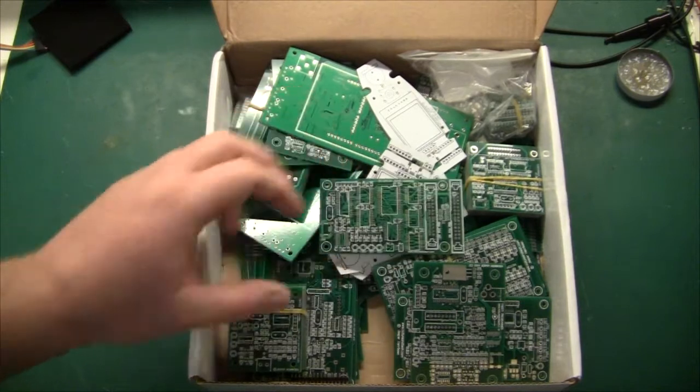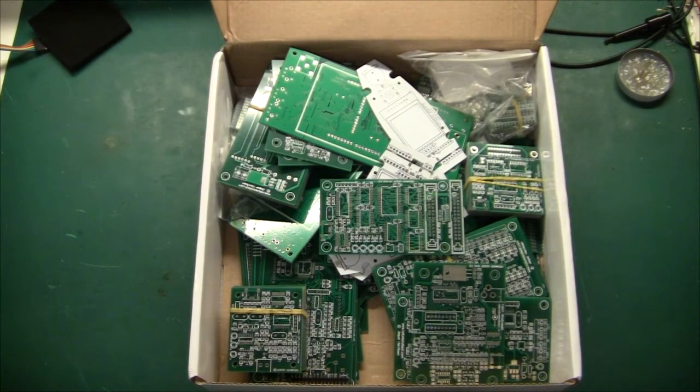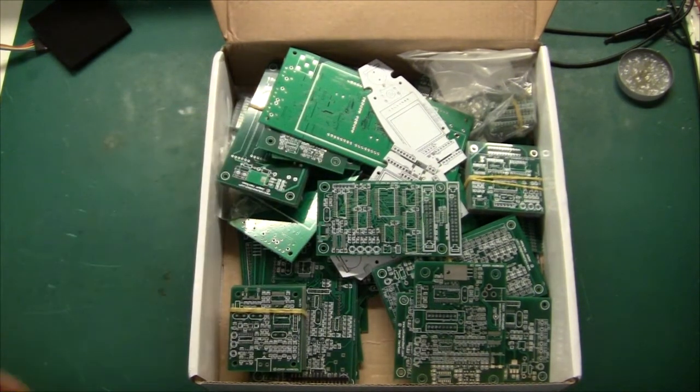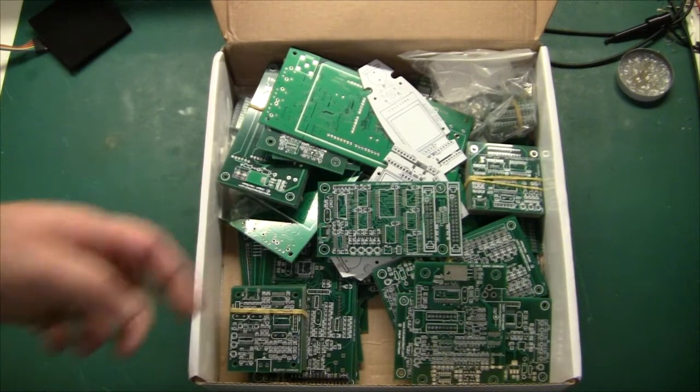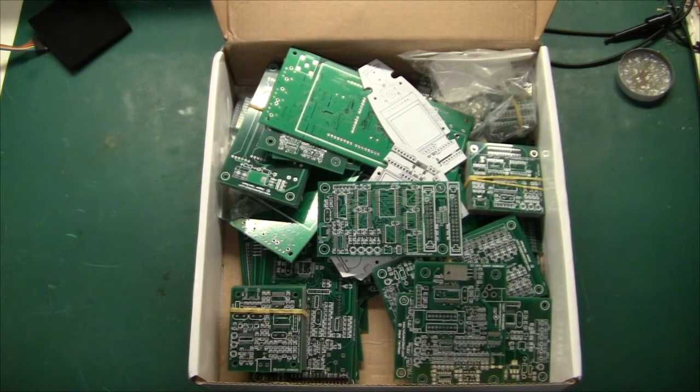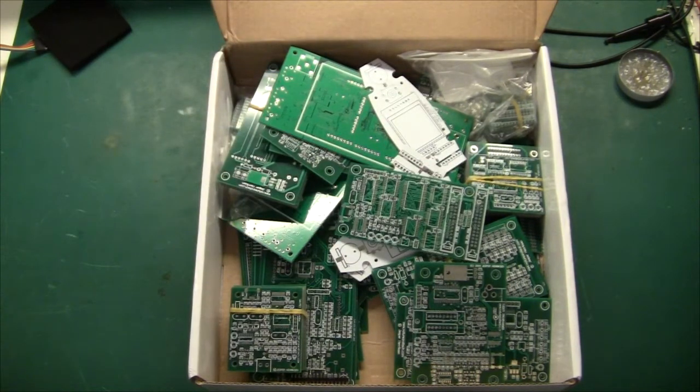So I've done an EEPROM emulator. It's not very high-tech these days with microcontrollers and all that, but I'm still playing around with old microcomputers, so I thought it would be interesting to do. This design is based on an ISA bus design I did in the early-to-mid 80s, but this version has a USB interface so it can work on a modern-day PC. If there's interest, I'll talk about that in more detail in another video.